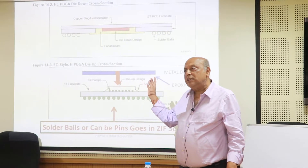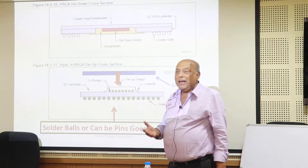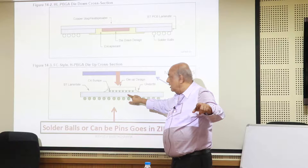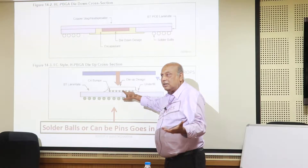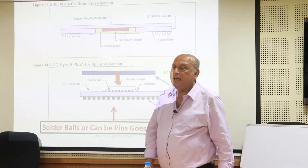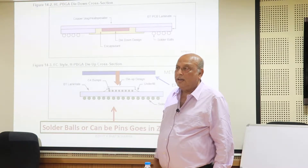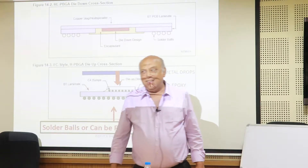So do you understand the technology? IBM built the technology. But the next question is: IBM built good, but they should all crack — because there is a mismatch, there is a mechanical problem. This is plastic — you heat it up, the plastic expands more, silicon expands less, then it gets soldered, you take it out, the thing bends, silicon cracks. Easy. But not a single one cracks — that is also solved. I teach this once in a world in an advanced packaging class, but no students come most of the time.